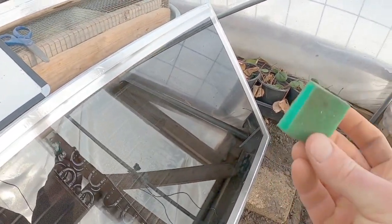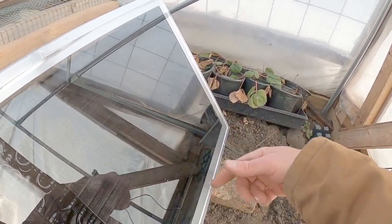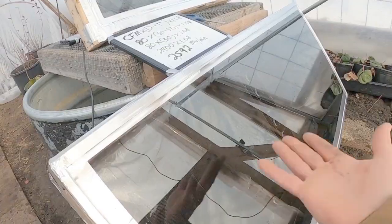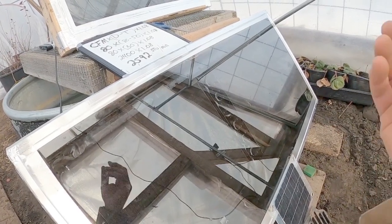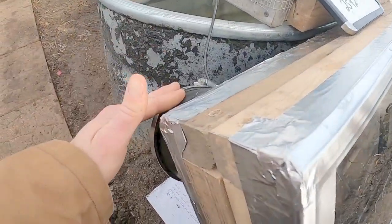It allows us to figure out what kind of BTUs we're putting out of a solar heating box, a furnace, or anything like that. It's so darn hard to see in this box, but I just wanted to come through and show everybody how it's set up. I wasn't getting the best airflow when I had the piece of foam in there, so I've got to use some hardware cloth. As the heat's rising off those fins it's mixing with the air coming in and raising it 30 degrees already, which is very very cool — and we've obviously cleared all of the condensation out of the box because it's warming up and blasting it right out the back side.